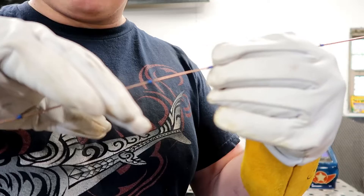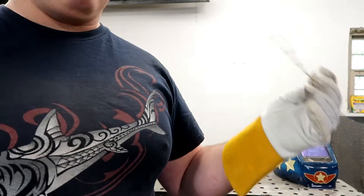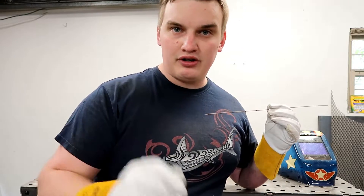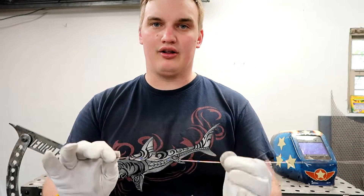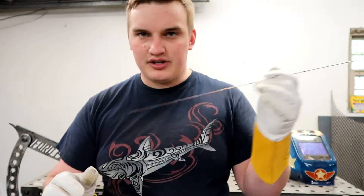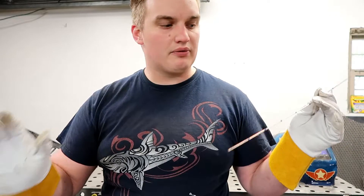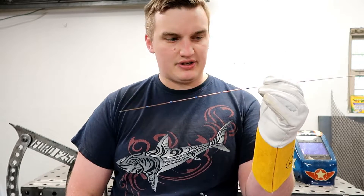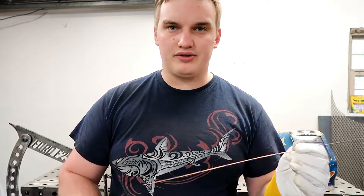The entire time you're going to be holding onto this rod in the same spot until you run your glove into your part and burn up your fingers. Even though this method is often preferred by beginners, the reason I'm starting with how to feed your rod is because of this. I know I even pushed back on this when I was first learning to TIG weld. It's often preferred because you're using one less set of motor skills you have to concentrate on while you're trying to control your heat and all the other things that go into making a nice TIG weld. The downside to this method is that the process of holding onto the rod is going to make it much harder to make consistent, clean, good welds for a couple reasons.